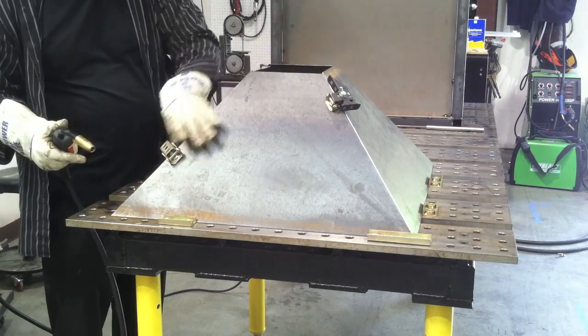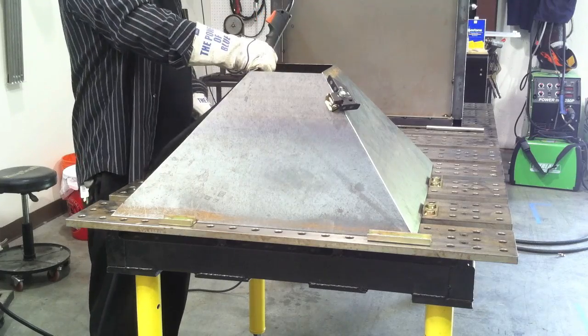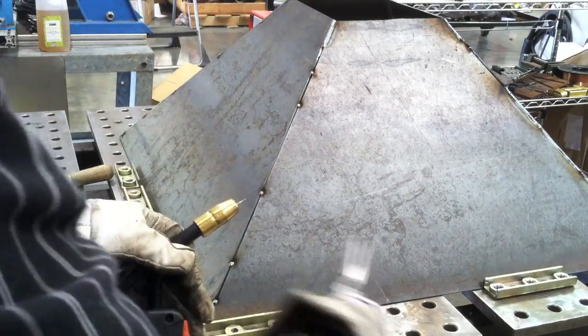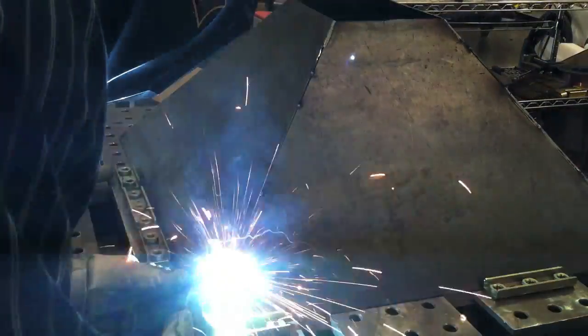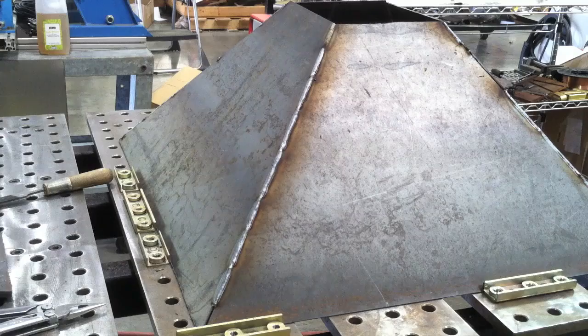We get it all tacked up — a bunch of tacks on it, probably every three inches or so, at least every five inches. Then I'm going to use a technique called backstep welding, and I'm going to weld everything downhill. On 16-gauge you definitely want to weld downhill. Backstep welding means I weld about three or four inches, stop, then go ahead of that and weld another three inches tying into the previous weld — that kind of limits distortion on something like this. You can see there are some gaps and some slag, and you might even see a little porosity here and there, but this is going to really look bad with all that dross on it in about a week anyway. Backstep welding limited the distortion.